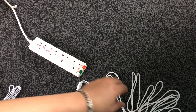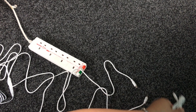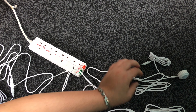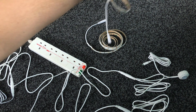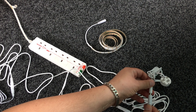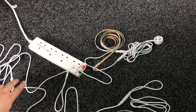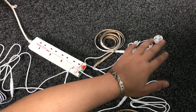Now let's move into the setup process. First, untie all of your cables. This is your main connection cable. Take your power supply — the power supply plugs into this connection here — but do not plug it in yet. Step two: take your motion sensors, also untied. These two connect together and will only connect into one slot, so make sure you connect them in correctly. Step three: take your two LED strips and connect them into these. As soon as you plug the power in these will work, so please be warned.